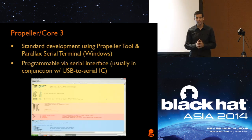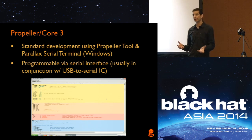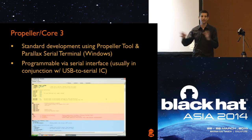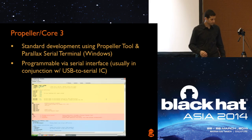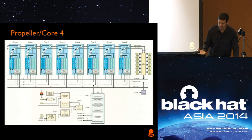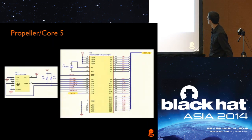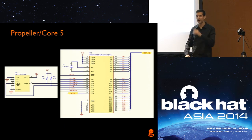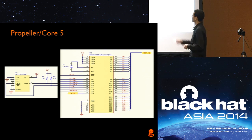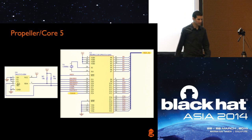Standard development is done with a tool called the Propeller Tool, which is actually in the Black Hat materials on the DVD. If you want to load that up, play with it, and load the source code in, you can. Right now that is Windows only, though they're also creating a cross-platform version. We program the device through the same interface we're using as the user interface — just one connector in. Here's just a block diagram of the core. From a circuit point of view there's really not much there: just the main part and a 5 MHz external oscillator. The loading capacitors are actually internal to the Propeller, and there's also the external EEPROM. Very simple to get up and running.